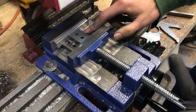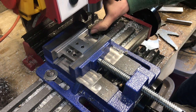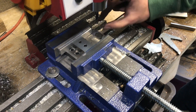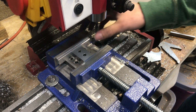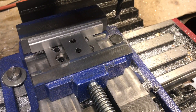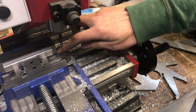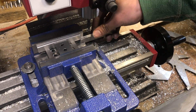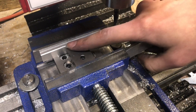This doesn't work without this tungsten piece underneath, because then the jaw is not very large and the part will sort of fold and rotate when it gets into the slot down here. I also want to add an eighth-inch step down on this aluminum bar to match the eighth-inch step in the vise. That way I can set the full-size one in the step down, and then I can put the other bar that I'm about to cut the eighth-inch step in.